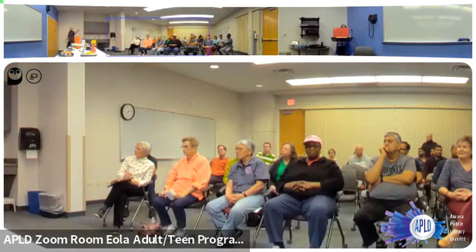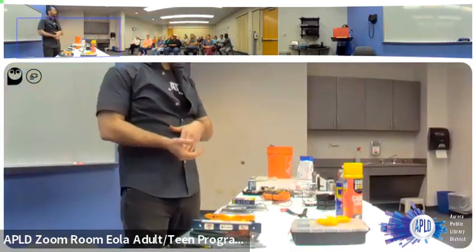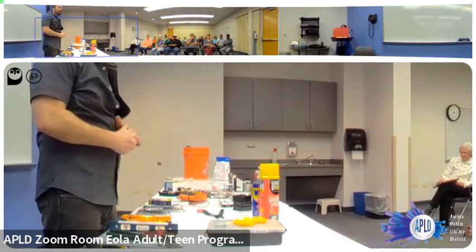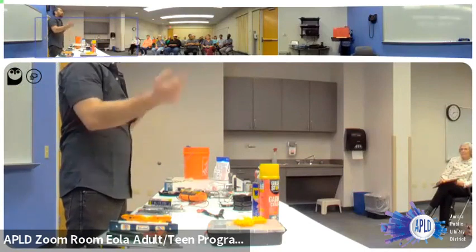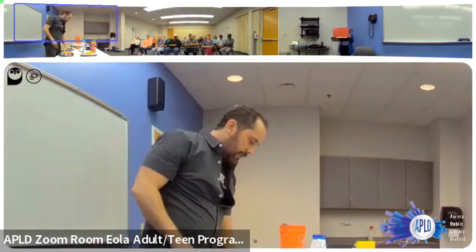The only problem with that thing, it's great, the only problem with it is it only works for outlets. You wanna change a switch? You wanna change a light? You want to change a fan? That thing won't do anything for you, okay? But that'll tell you once you turn the breaker off that the outlet's off, okay? And when you're all done, it'll tell you if you wired the outlet right. Okay, so it's great for outlets.